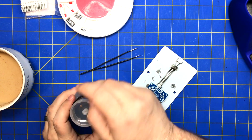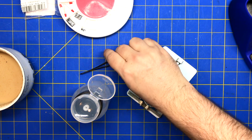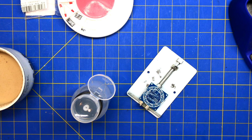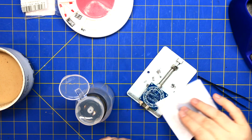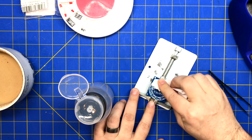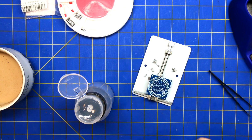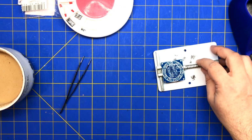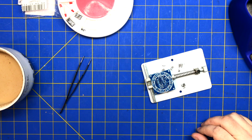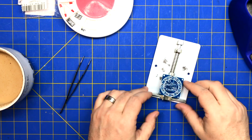The first thing we want to do when you get a board like this, when you don't know where it's coming from, and it's not sealed, is you probably want to clean it. I need to make a holder for these. You probably want to clean, probably cut some of these in half. I don't need that much. Just clean it with some IPA, some alcohol, vodka, whatever you got. Make sure there's no oils on it. That's just ISO 70%. That's purple. I don't know why I put ISO, not IPA. Same number of letters. Alright, so I guess we'll do these ICs first.